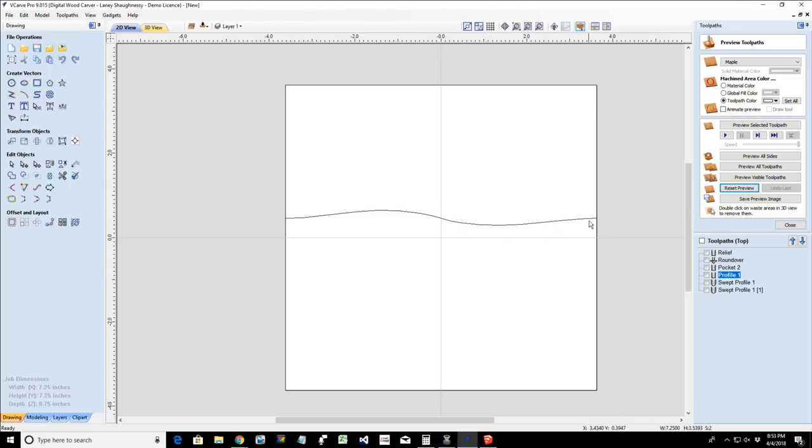Whatever we do with our curve, when we create that molding toolpath, we need to make sure that when we mirror it or reverse it or what have you, those two halves can fit together. We wouldn't want to be too dramatic, because we're most likely going to be veneering or bending pieces in here of a contrasting color if you're making decorative rings and things. So you want to make sure that you have nice, smooth, flowing curves.